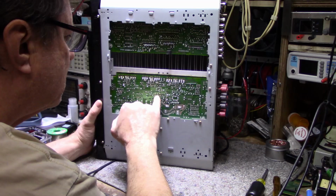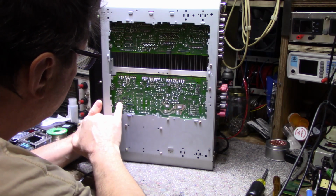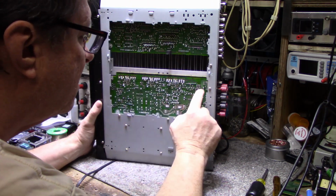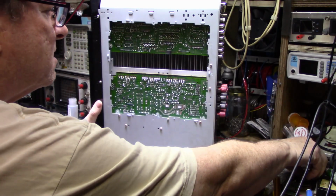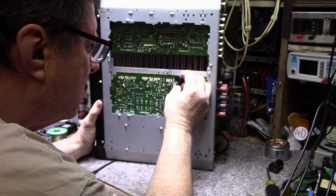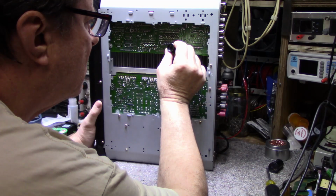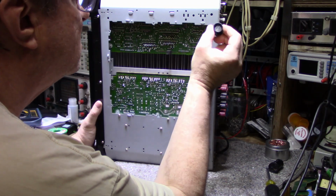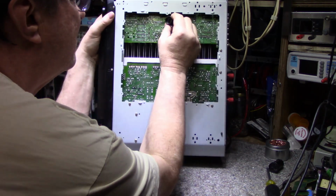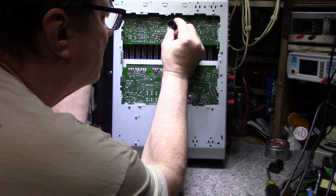And I'm looking here, there is cracks on this transistor. The soldering is really weak on this thing. Look at this bodge here. They got a little diode tacked in there. I don't know what that's for. Let me have another look at this. Looks good so far. What about up here? I got one crack there, right in the center too. That's unusual.